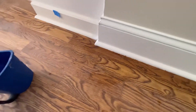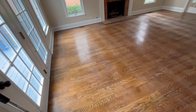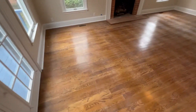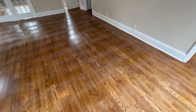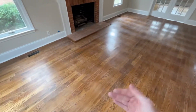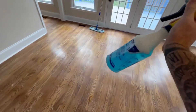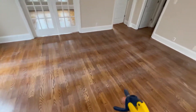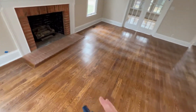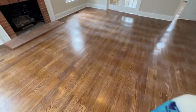We've officially got these floors screened down, went ahead and vacuumed, and now we are in the clean and tack process. This process is just to make sure we got all the dirt, dry particulate soil, hairs, anything like that — because we don't want to see any of that in the finish. Once we roll this finish on the floors, it is under that finish. We're going to use our preparatory cleaning system and our microfiber mop to ensure we don't have a film of residue or acrylic waxes that would interfere with the adhesion of our new top coat.